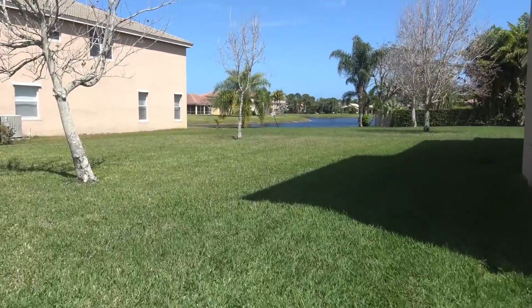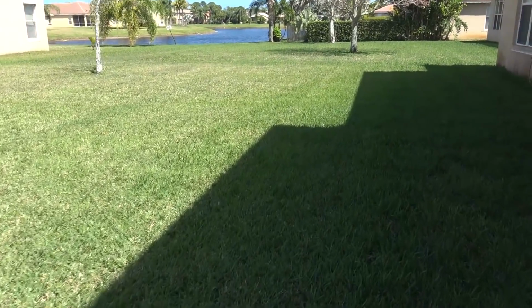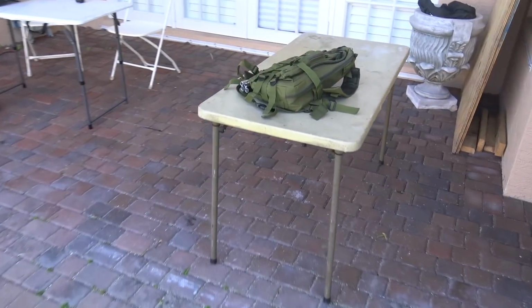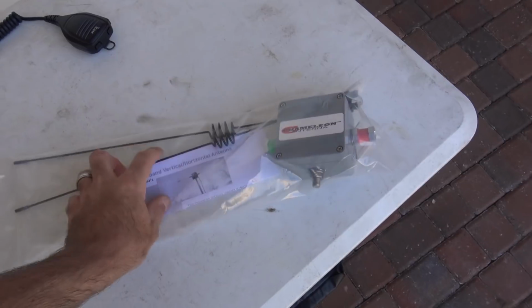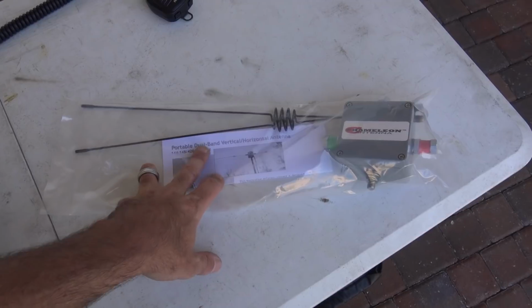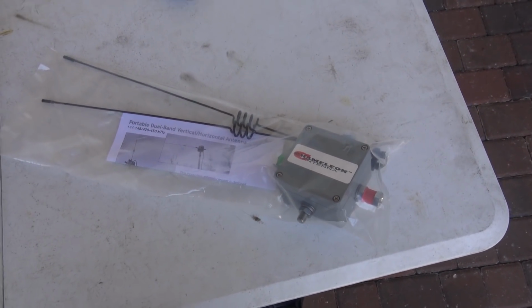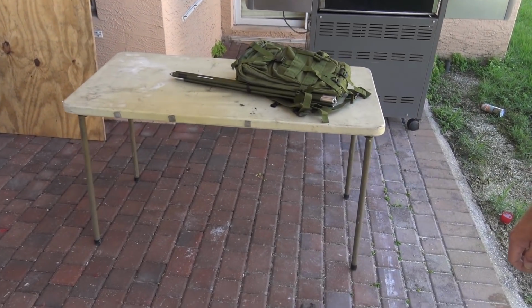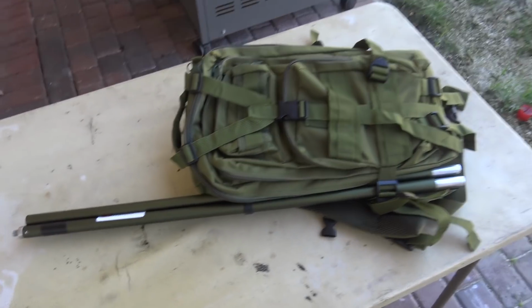Let's set up my Chameleon real quick, and then in the next video I'll show you the VHF UHF add-on kit. Have you seen that, John? I've seen it, never used it. Check it out. I'll show you this in the next video. Here it is. This is a Chameleon. I saw this after I realized it was newer, and this is the portable dual band vertical and horizontal add-on kit. So now if I get the 705 ICOM, I can do everything with this antenna in the backpack from 160 meters to 70 centimeters with one radio and one antenna. That's going to be amazing. So let's play with this.